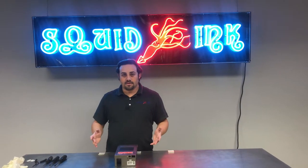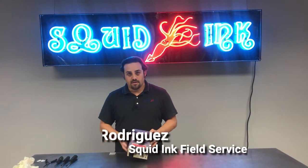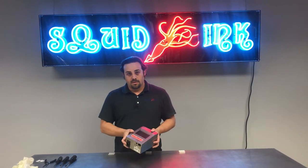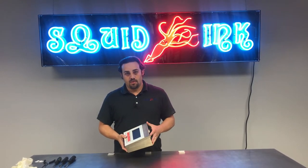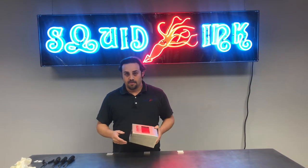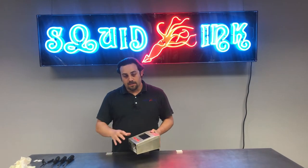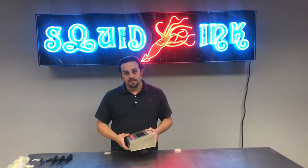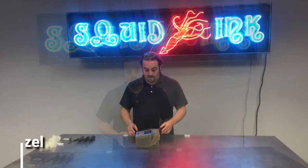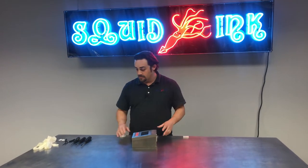I'm Nick Rodriguez with the Squid Ink service team, and today we are going to take apart the CoPilot controller. Now, the things that we're going to be doing today with the controller are going to be applicable to any CoPilot system that you may have, whether it's 500, 256, 128. We're going to take a look at the parts, what's replaceable in the field, and show you how to do that. First thing we need to do to take this apart is to remove the bezel.